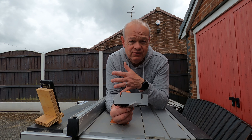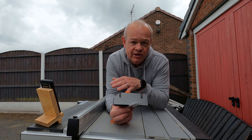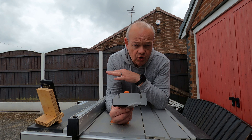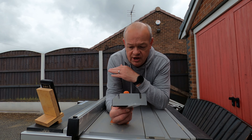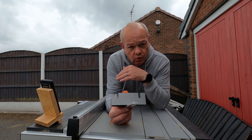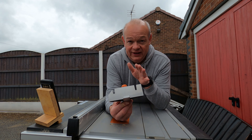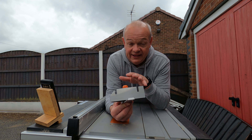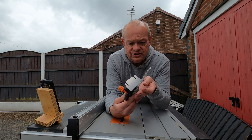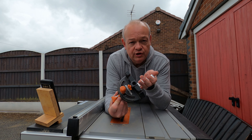I'm not going to do anything complicated — this is going to be a really simple build but hopefully an effective one. One thing I am going to do which might be slightly different is go for more of a sled type — not a thick piece of solid wood. I'm going to have a thinner piece of wood with a frame around it, sort of like a catamaran, so it's not big and heavy and I won't lose cutting depth. So the first thing to do is take this apart and see how much play we've got in the actual miter saw slot.